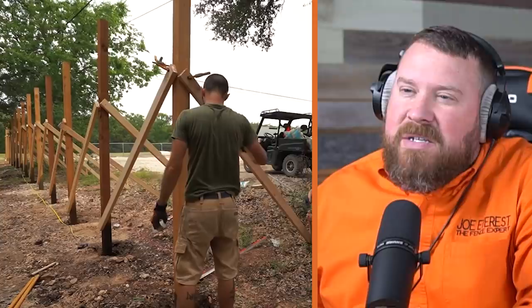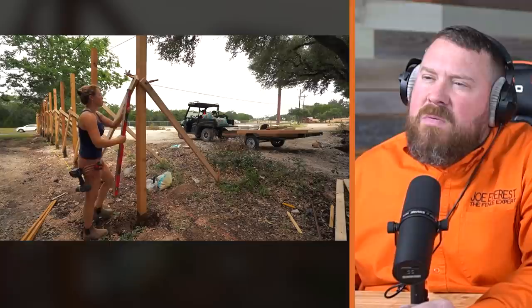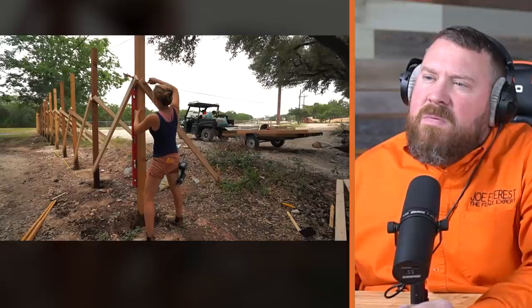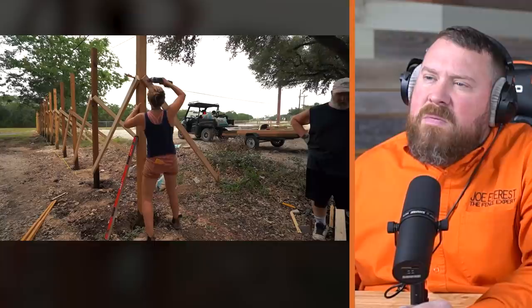While I was doing that, you could see Jake using a second clamp to hold the top up. Now that it was roughed in, we did all of the fine tuning, and this entailed using a level on 2 adjacent faces to plumb it up. We would loosen 1 clamp at a time and reset it when the post was plumb in that direction. After being reset, one of us would come back with a screw to hold it more securely while we moved on to repeat the process with the next one.